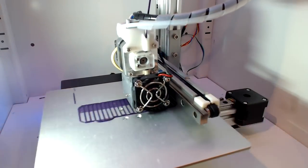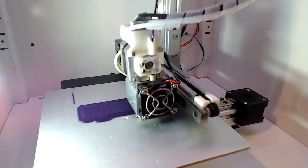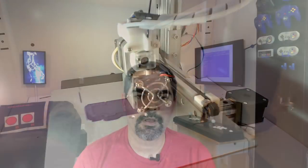I highly recommend placing a printer in an enclosure with a carbon filter, or having it vent in some way. I considered putting my printer in my garage, but 3D printing is very temperature-sensitive — you want a temperature-stable room. If placed in a garage where it gets cold at night, or where humidity fluctuates, it can warp and bend your print. Many prints need a stable temperature to come out well, based on the filament type. Be aware of where you'll put your printer, but know you may not need to keep it right next to your computer.